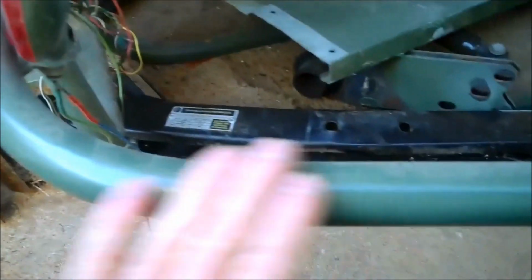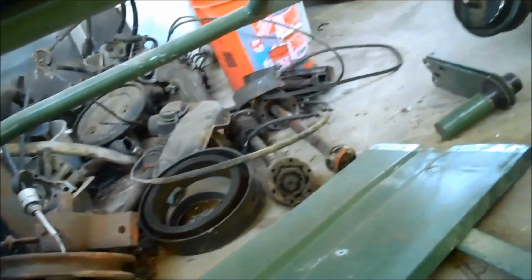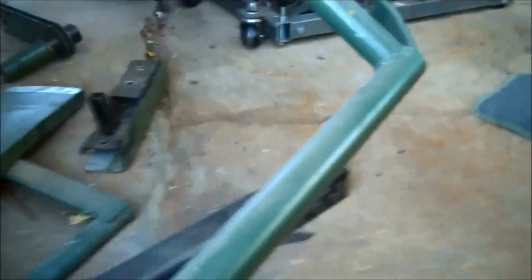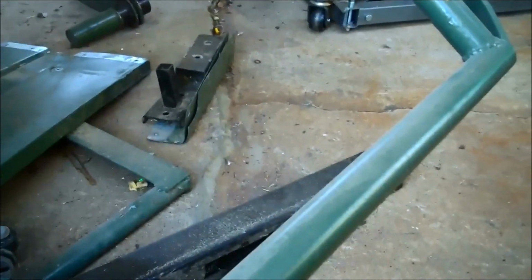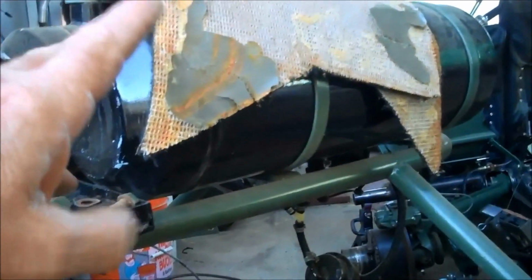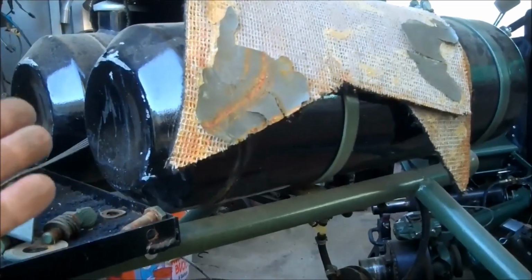So this one is, like I said, 100 inches all the way around, and you just bend those, and you can actually buy these from the buggy shops and whatnot. They sell them, but those are thin tubing, and these are Schedule 40 pipe. There's no tubing on this trike anywhere. Now this particular scooter has gas tanks up here. I don't normally do that, but that's what he had, so that's the way we did it.